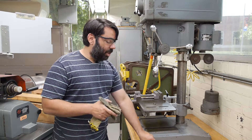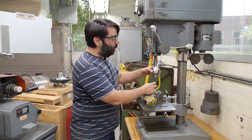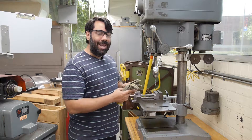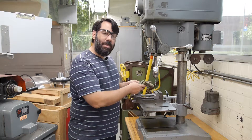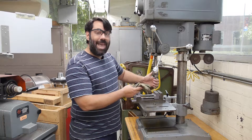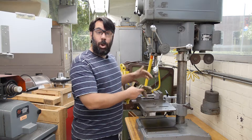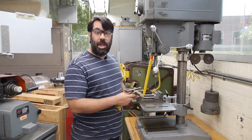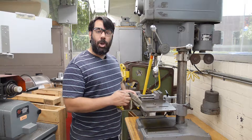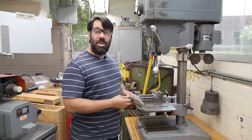In the case of a drill press, the risk is that you will have a drill clamped in the chuck, and as that drill is rotating, if your hand ever comes into contact with that drill, the glove will get caught on the rotating drill causing your hand to get wrapped around the drill and pulled into the dangerous cutting zone on the machine. So don't ever take the risk of wearing gloves around the drill press or any powered equipment in any shop facility.